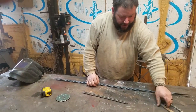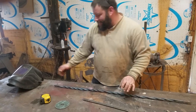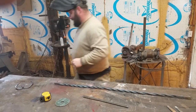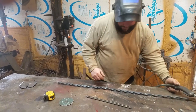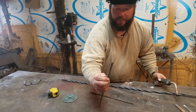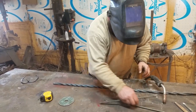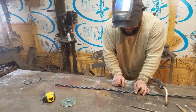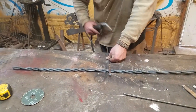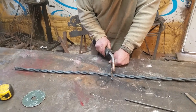Here's where it's kind of cool. You could use a vice grip clamp if you didn't want to cheat and use the welder, but we're going to use the welder. If blacksmiths of yore had it, they would have used it, right? I've got one end dressed up to kind of be like my barb — the end of the wire on a barb, if you've ever seen a barbed wire fence. We're going to lay that on there. The barb needs to stick out about that far, kind of at an angle, not too much. On the side where it's going to overlap so that we hide our weld with the wrap, we want to weld it — just one side, not both.